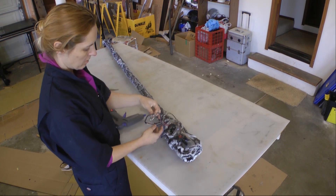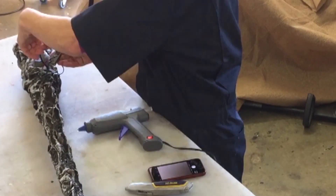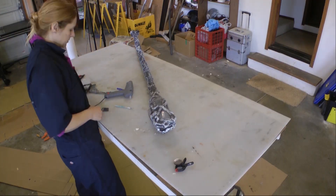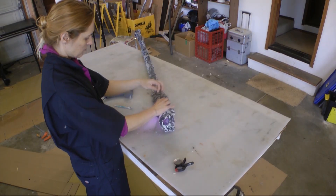Cut a small hole for the on-off switch and slip it through to the outside. Finally, secure your microcontroller and NeoPixel ring in place with some hot glue, being sure the USB port is accessible for charging and updating your code. Close up the flap and glue your on-off switch into a hidden nook on the outside of your staff.